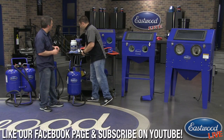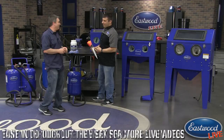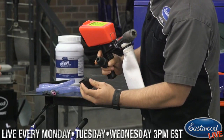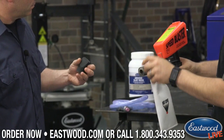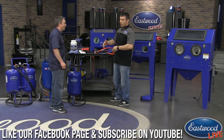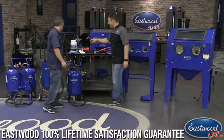With the recovery system, you press it against a rust spot, pull the trigger a couple of quick times, check your progress, and it recovers the media back in — leaving a clean dime-sized spot you can then paint over. There are also smaller nozzle attachments: roughly three-quarter-inch for general spot cleaning, and a half-inch version for getting into small seams or tight outside sharp edges. When held tight, you reclaim 99% of media back into the bag. This is great for door edge dings from shopping carts.